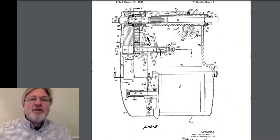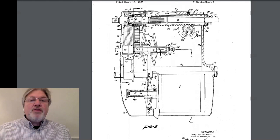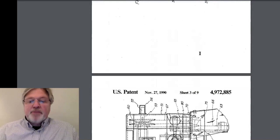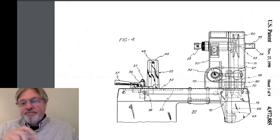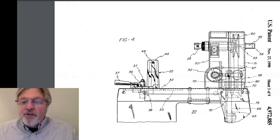This has worked great for many years, but we're still not done — there have been more evolutions in speed control. That takes us to 1989, when ShopSmith introduced the Power Station. On the front of the Power Station — also the Crafter Station — we've got a crank, and this crank tightens in place with a lock handle. And you can see transparently here, there is a pulley and a belt running down, and then another belt coming down to the motor pulley.